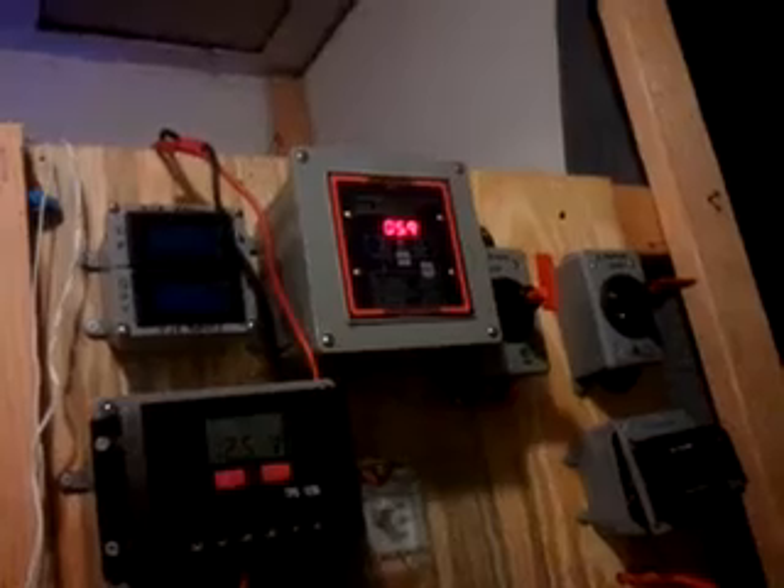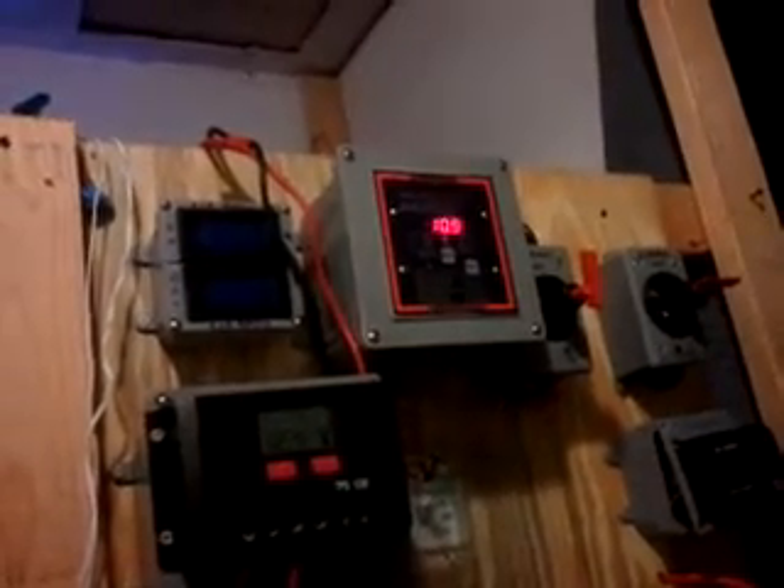So they've been kind of dragging. I'm turning the unit on — watch the amps. Notice that it's slowly growing. The amps are being supplied fully to the AC unit right now. The only reason the amps are slowly climbing is because the capacitors are actually compensating for the energy that's not coming from the batteries all at one time. This is my battery meter, reading the amps coming from the battery — the capacitors are going straight to power the inverter.